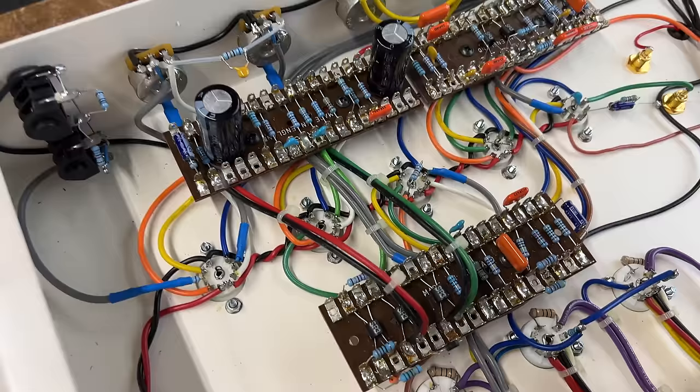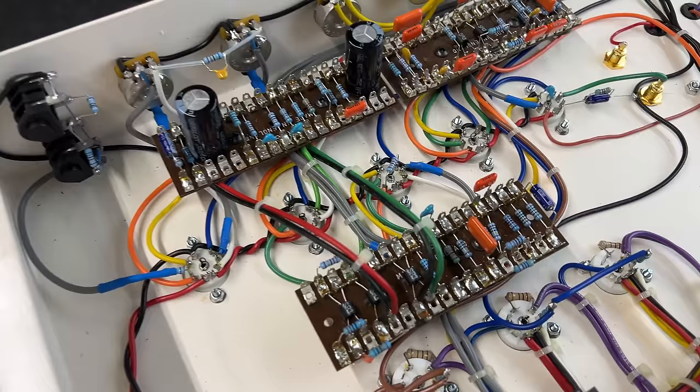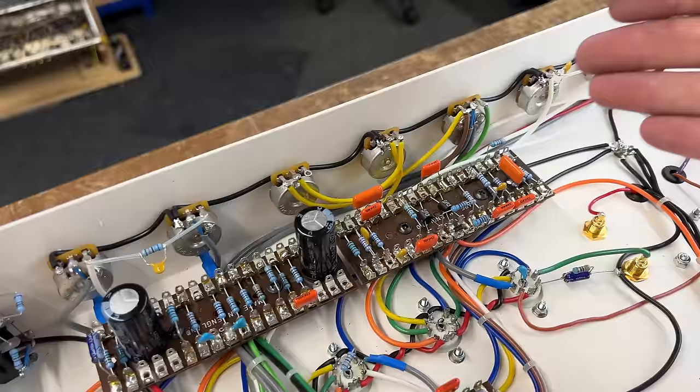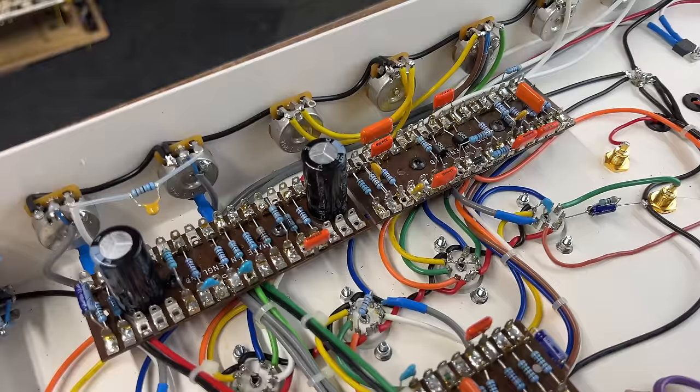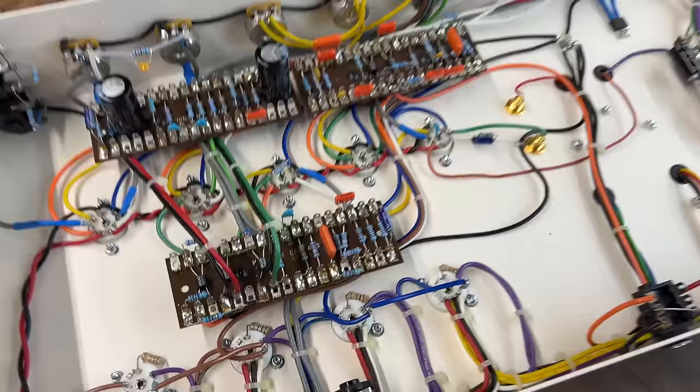Because often you can get issues where people have put, for example, a 12AT7 where a 12AX7 should be, or vice versa. We need to check the operating conditions of the output valves, and we need to see if we can work out why this tone stack, considering that it is an anode follower, which tend to be the more powerful type, unless it's a James, isn't doing what it's meant to be doing. So, yeah, Cornford Hellcat